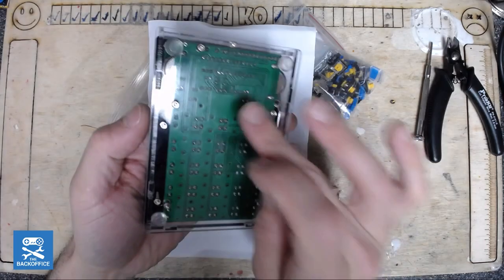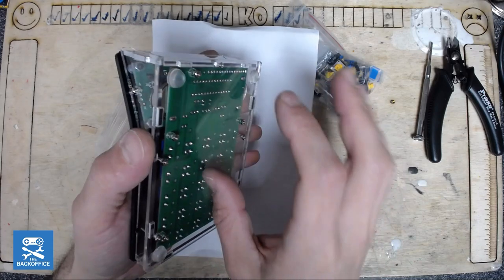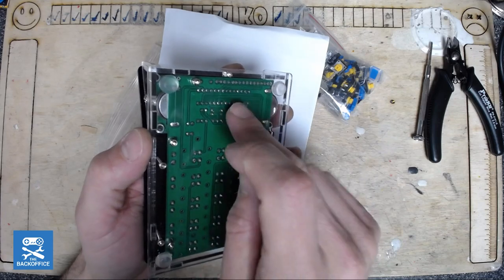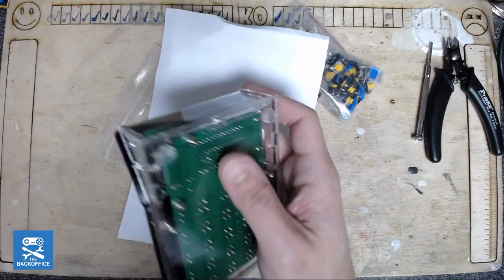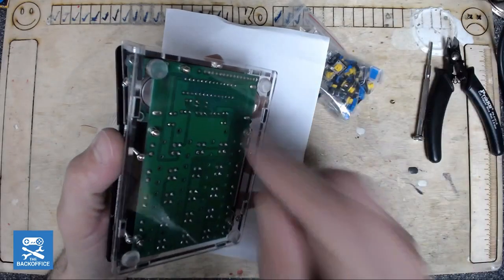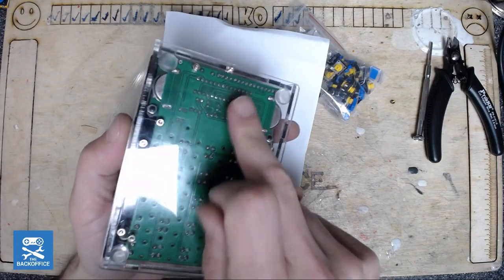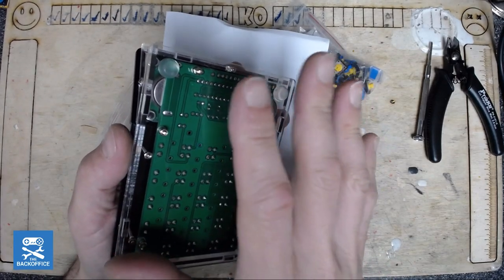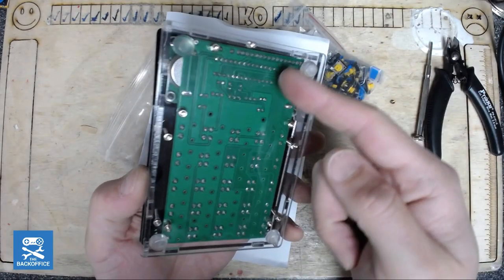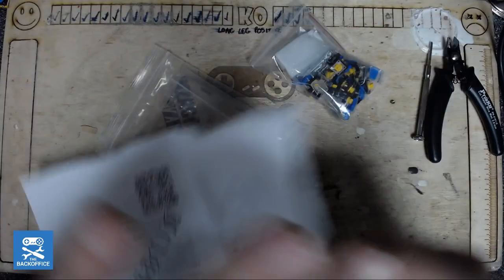By the way, I did check this out. The IC in here, this microcontroller, is a really odd, weird one that you can only get in the Far East, and you certainly wouldn't want to code for it. It's based on something like what they'd have in a Commodore 64. I've worked out you can rip that out and probably put a PIC daughter board in there and run your own code. The pinout's pretty simple. You could definitely get a PIC to do all this and program your own calculator. But not only that, use extra GPIO and make it a data logger with an SD card or whatever else you want. So that could be a fun thing to try.